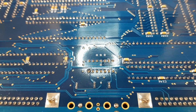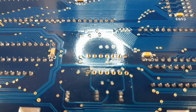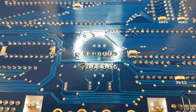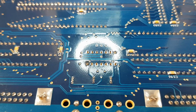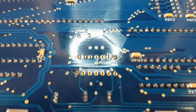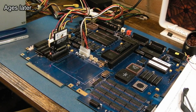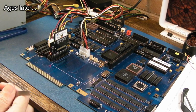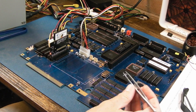I've just spent half an hour wondering why the audio circuit sounds strange. Look at the op-amp, it's not soldered on though. I was comparing right channel to left channel components, and getting different readings on the right channel. Why does the right channel sound weird? There we go, that would explain it entirely. You're not going to believe this, after hours and hours of this, I spent another whole day on this.